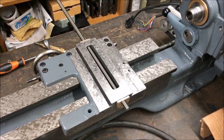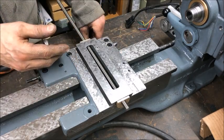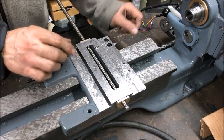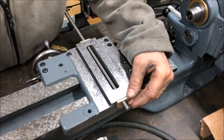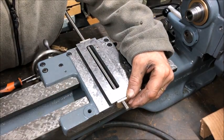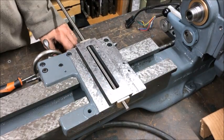I have now moved over to the cross slide and I want to have a longer screw, also supported at both ends, replacing this one which is too short to mount the motor at the rear end and have the screw engaging in everything. For backlash adjustment I also have a nut — I do it like I did on the other machine: I drill and tap through here so I have a screw in at both ends, setting the distance between the nut and the casting to get the correct backlash.